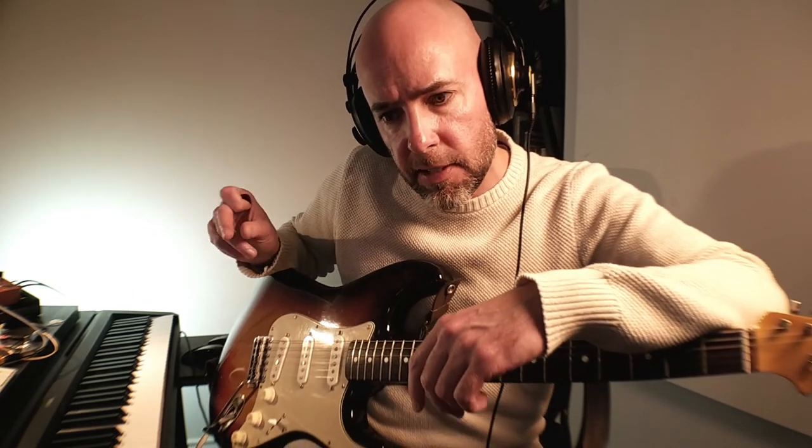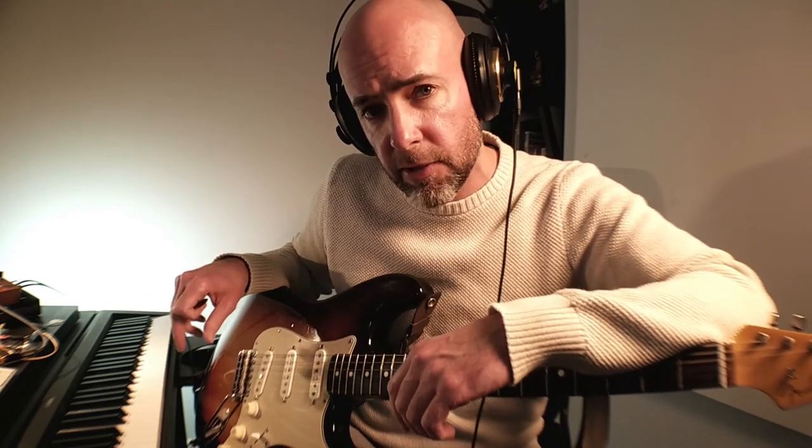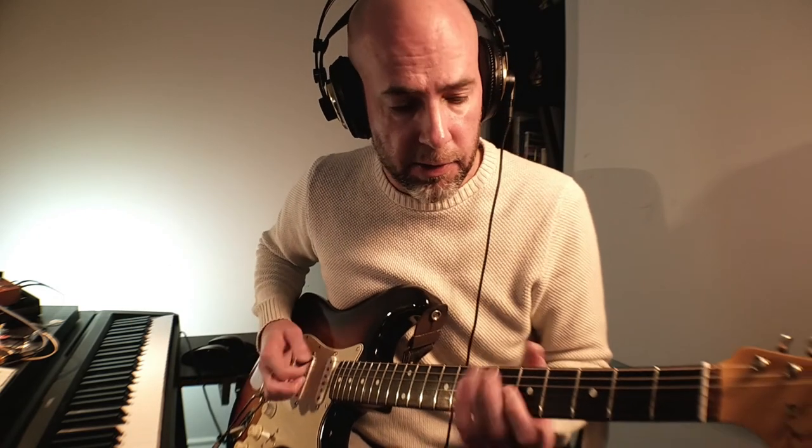One more note about the fuzz that gets added into each of the delay cycles. I believe that the amount of fuzz decreases as you increase your DC power to the board. So I'm running 5.5 volts into it, and I did a test before. I don't have the setup right now, but I did a test, I believe, with 9 volts, and there was less fuzz put into it. So it's possible that I'm underpowering it, and for some reason that causes the fuzz.